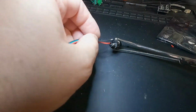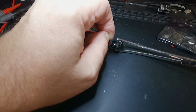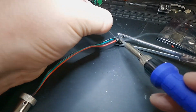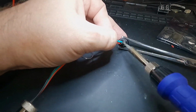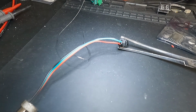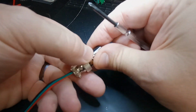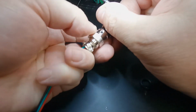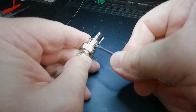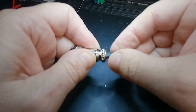So on the back of that chiller, there's an alarm output. It's a 3-pin connector. Now the interesting capability of that is to use it for something, and I'll show you how I'm going to use it. So one of the pins is common, the other 2 are green and red. So you can use them for, in my case, a light tower, and that's what we're going to do. So I wired up 3 conductor wire to the respective pins. So black is the common, red and green. So red would represent an alarm state, and green would represent a good state. So we can use that to add some intelligence to the machine.